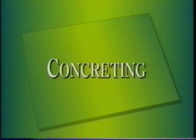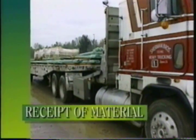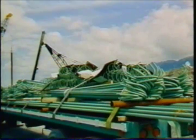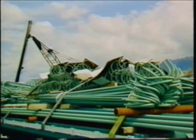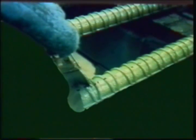To ensure quality on arrival at the job site, the manufacturer has carefully loaded the epoxy-coated rebar onto the trailer with nylon straps and placed the bars on wooden timbers. Before unloading a bundle of coated rebar, make certain that the tie-downs are secure. Check for proper padding and bar separation on the transport. Visually inspect epoxy-coated bars for damage and check the coating on sheared ends. If you find uncoated or partially coated sheared ends, patch them and any other damage immediately.